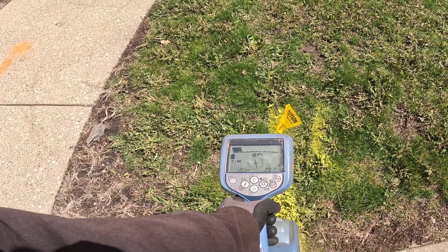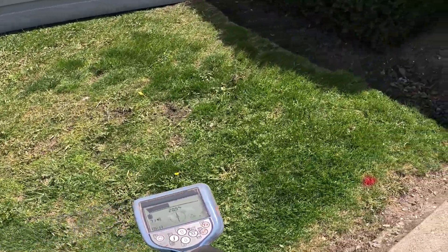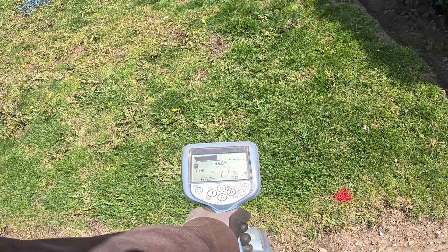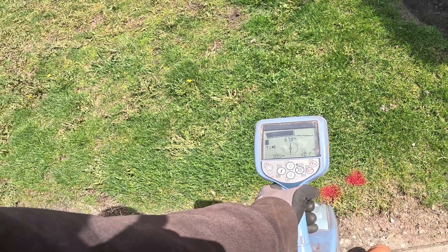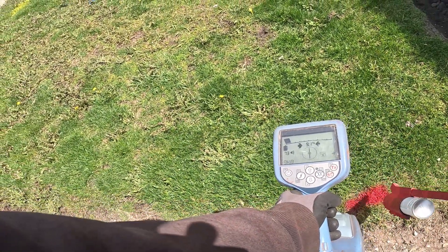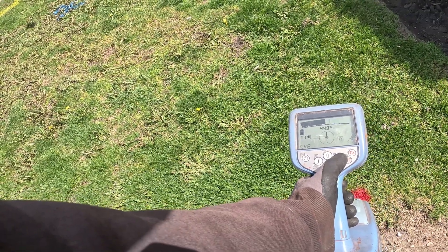You can see I'm over the yellow, so that's gas. Now the bars on top start moving — so this is my duct bank. I'm gonna make sure the null is good. Good null, right over my peak. So I know I'm on my duct bank.